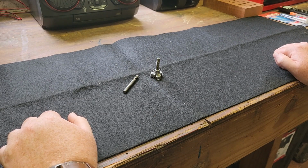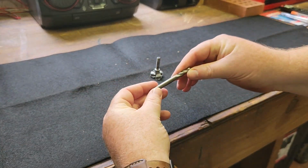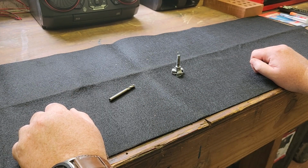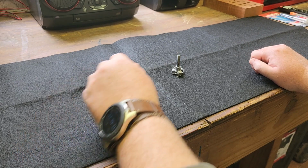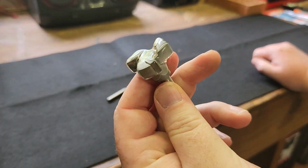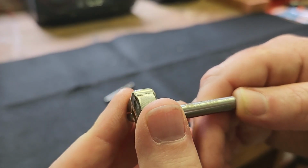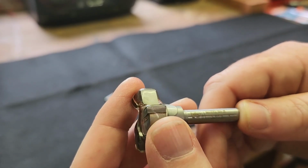Now, most of my projects have been pretty small, so I've been able to get by just facing with a little 1/4-inch flat end mill. But I wanted to get something a little bit more efficient. So instead of biting the bullet and just going ahead and buying a planer, I just went the cheap route, spent $35 on this little 1-inch face cutter. Now this is made by Whiteside and it's got 3 carbide teeth, and it says it's for spoil board surfacing, but we're just going to use it as a general facing tool.